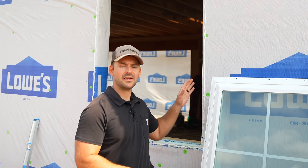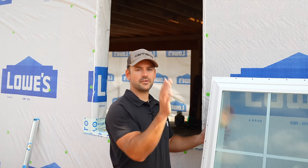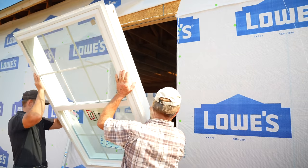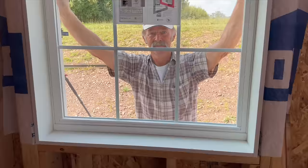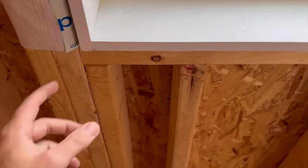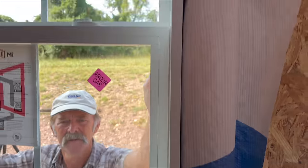It's now time to set the window into the opening. The rough opening is about a half inch bigger than the actual window, so it should sit in place very easily. You definitely need a helper here — he gets on one side, I get on the other, and we set it right up into place, bottom in first. With him holding the window, I go on the inside to make sure we're sitting perfectly centered in the opening. I check the gap on each side and slide it until the gaps are equal.